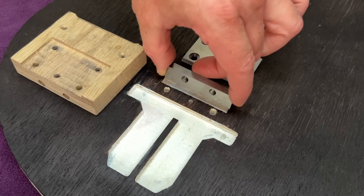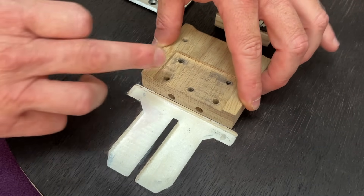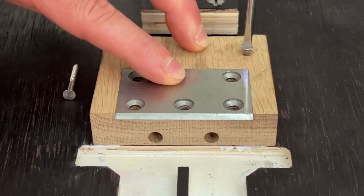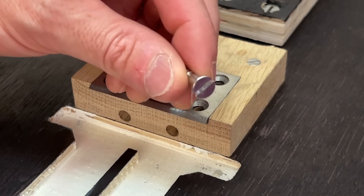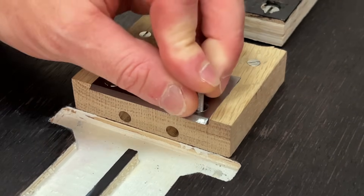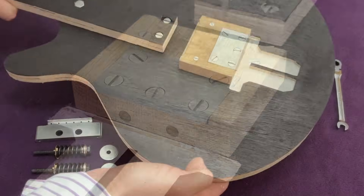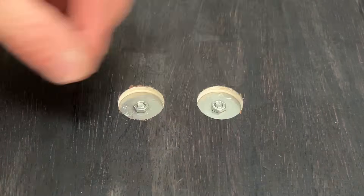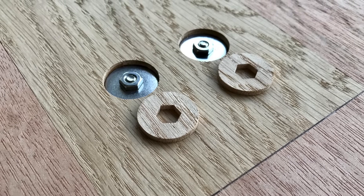As you watch me assemble the components, I'll describe the hardware and the fasteners used in the installation. The set screw retaining bar is rebated 1/8th inch into the lower body section, and 3/8th inch into the upper oak block. The oak block itself is glued and screwed to the lower body section, with two number 6 by 1 and 1/4 inch long countersunk slotted wood screws. The knife edge bearing plate is secured to the oak block using three number 10 by 1 and 1/4 inch long countersunk slotted wood screws. This assembly is anchored to the lower guitar body section with two 3/16th inch BSF thread by 1 and 1/2 inch long countersunk slotted set screws, which are bolted onto 1 inch diameter repair washers with half nuts. These shallow rebates would likely have been filled with epoxy resin on the original guitar, although on my Red Special build I took advantage of my CNC machine to make oak biscuits, to cover the bulk of the space around the hex nuts, then I filled any remaining smaller gaps flush with high performance wood filler.